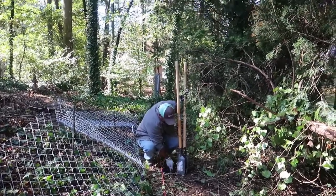We're gonna have to use those post hole diggers. So the idea here is that we're gonna dig a little bit, just about maybe 6 inches or 8 inches, that way we can pour some concrete around the base of that pole. The rest of it, because it's gonna be buried in there at least 2 feet, we're actually just gonna use the, I'm not exactly sure what it's called, but you'll see what we're going to be using to drive them down into the hole.